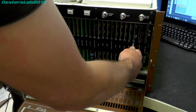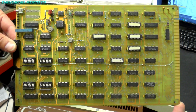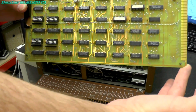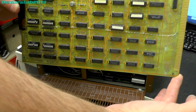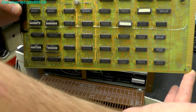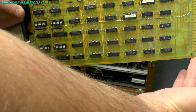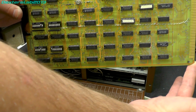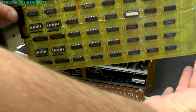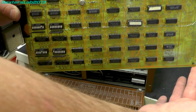And the next card along is output timing. That's the output timing card. The service manual says the output timing card serves 3 functions: to generate all the timing signals for the system, and make sure that they are gen-locked to the incoming locking signal; to store the cursor parameters and generate the timing signals required to place the cursor colours onto the video output; and to provide 32 switches readable by the system computer to act as configuration switches for the software.